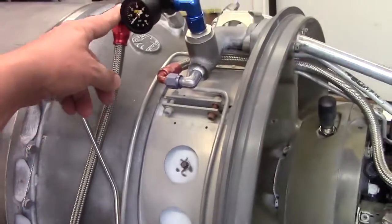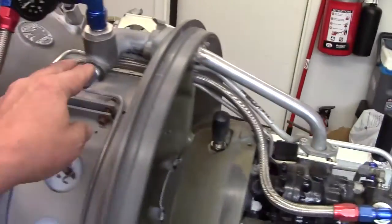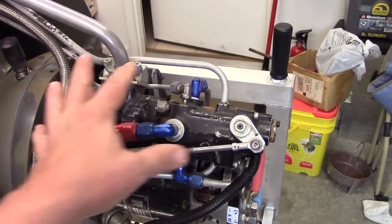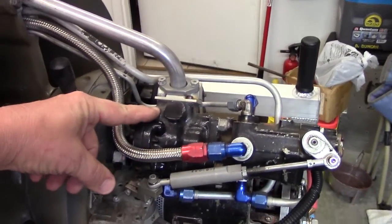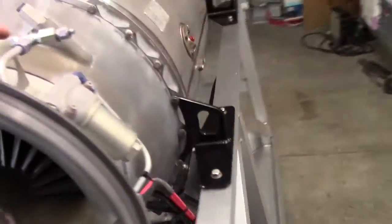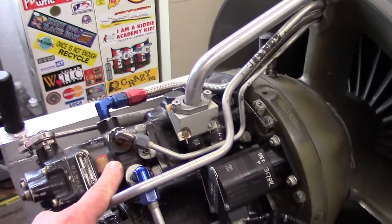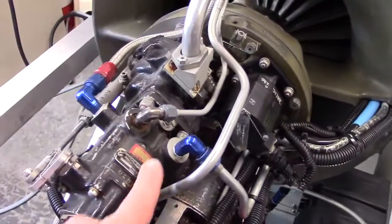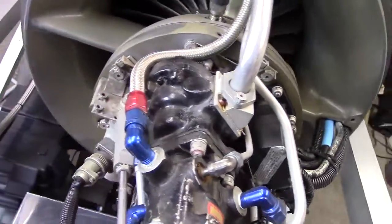From the fuel pump, through the filter, it comes through to this point here on the top, which is the fuel inlet pressure gauge — just to monitor inlet pressure. Then through here is your fuel pump. This assembly is the fuel pump, fuel control, and governor assembly. This is the pump that generates the pressure used to spray the fuel nozzles. It comes from the pump through this line, plumbs around here as a T, goes through this filter back into the fuel control. The fuel control controls outlet fuel for the governor in relation to the power setting lever.